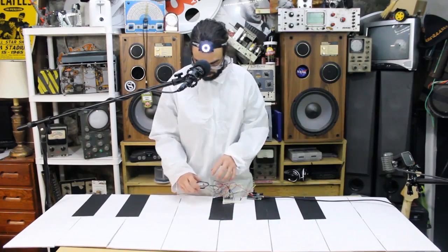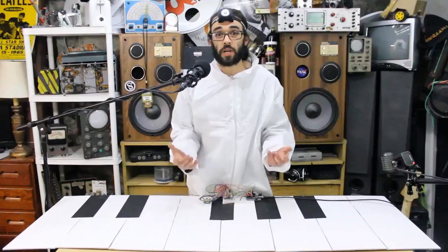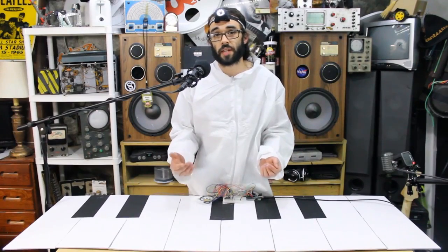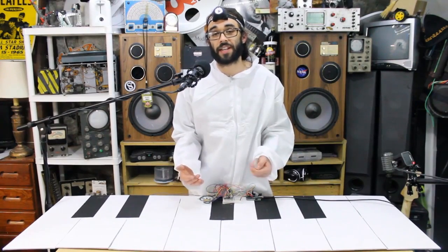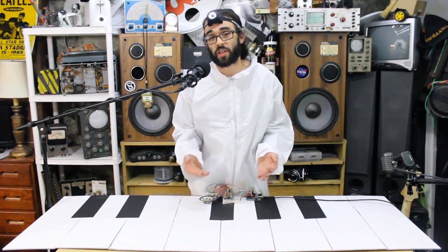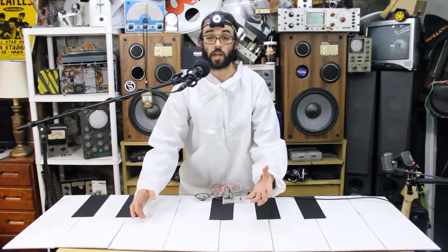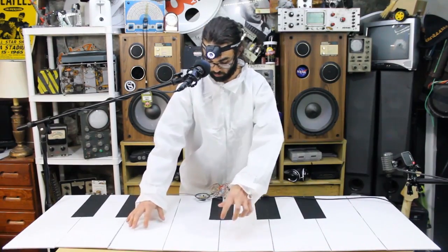This little speaker will produce sound according to the frequency content of the digital signal. Because we are using square waves, the signal has harmonic frequencies in addition to the fundamental frequency. The sound would be much better with a sine wave, but the square wave will do just fine for our purposes. You can't hit two keys at once because it makes a weird sound.